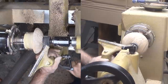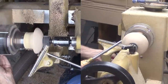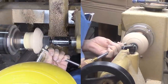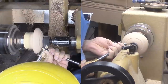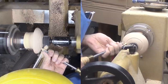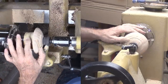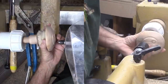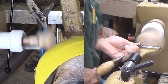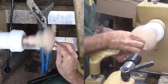Now I've used hot melt glue to attach the lid to the work platform for the infinite axis chuck, with the work platform being held in my scroll chuck. The work platform has a mounting tenon I can use whenever I want something perfectly concentric to the primary turning. I'm cutting a shallow cove in the surface. Now for the infinite axis chuck — I've marked angle divisions on the perimeter of the work platform, and I'll use these to align the chuck since I want features with equal spacing.